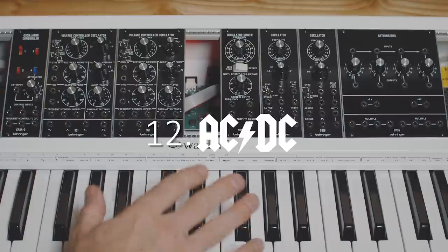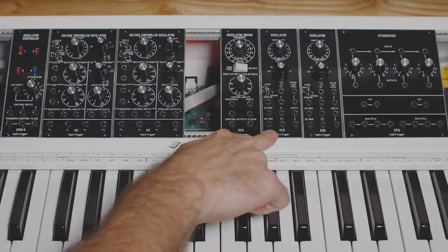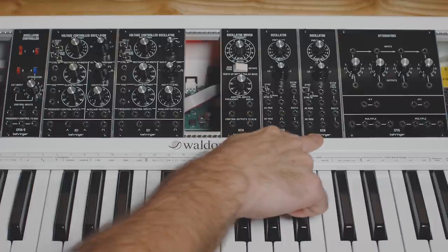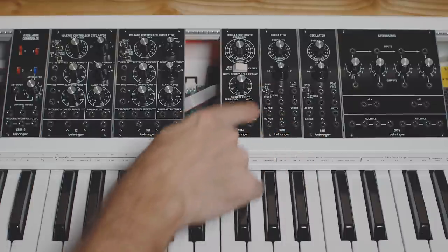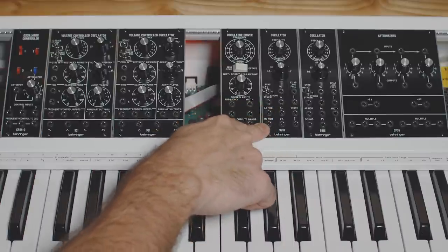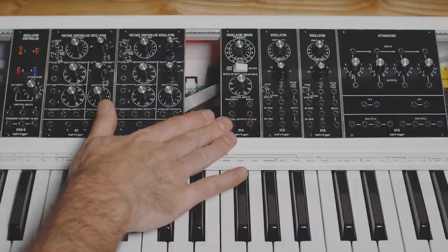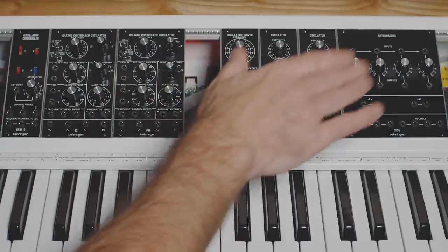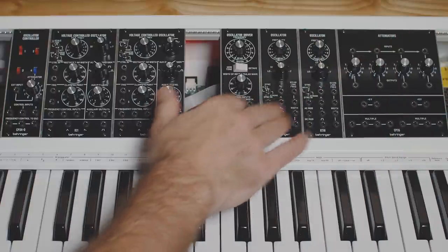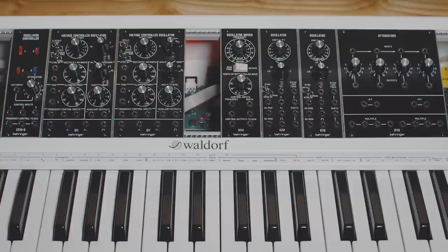Okay, so last but not least, I think the only thing that I haven't covered really on the front panel here is this AC and DC mod input on the 921Bs. I have to confess, I haven't used these patch inputs. I haven't found the need to use them yet, but I believe that they are frequency modulation inputs. So that means that rather than going through the 921A and having consistent frequency modulation across all your oscillators, what you can do with these is modulate them independently. Now, AC and DC, I am presuming, is the difference between bipolar and unipolar in terms of expected modulation signal.